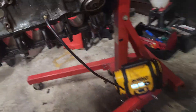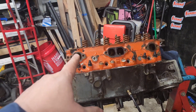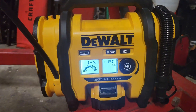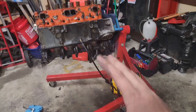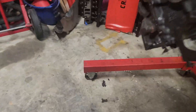I got a couple of things adjusted on there — one of the rubber sheets wasn't quite sealing right. Changed out some hardware and now we're holding 15.4, 15.3 PSI. This is going to fluctuate a little bit, but the fact that it's holding pressure at all is your first good indicator. Now we're going to grab our soapy water, start soaking it down, and check for any slow leaks.